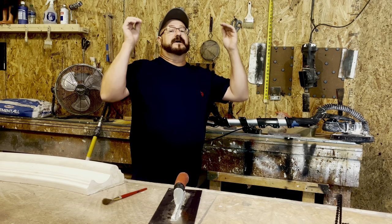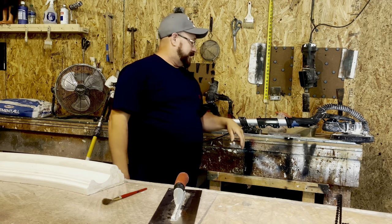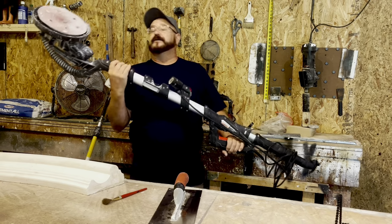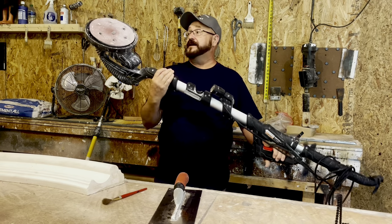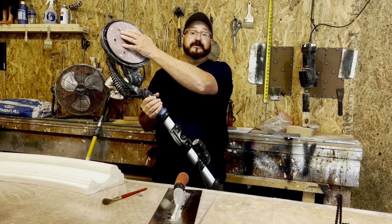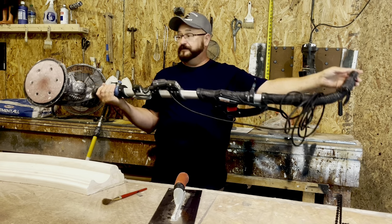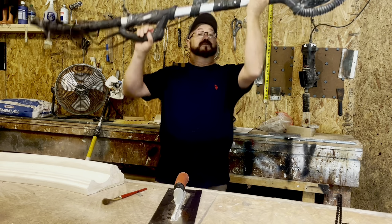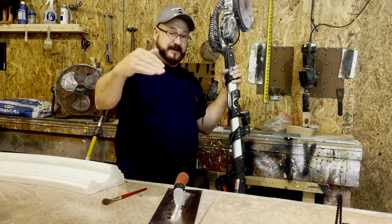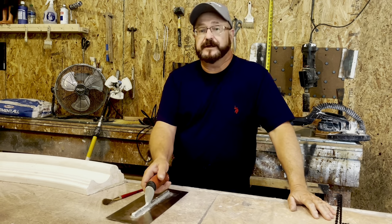Anytime you get one of these, the quickest and most effective way of getting it flat, and we used the Benford 3000. No, I'm joking. We use a drywall sanding tool. Yeah, they're aggravating. I use a 60 or 80 grit. I've modified some. I hook it to my vacuum, and we knock off the high parts on that ceiling. As seen in the video, it's not completely flat, obviously, or I wouldn't have to float it. So sanding this down,